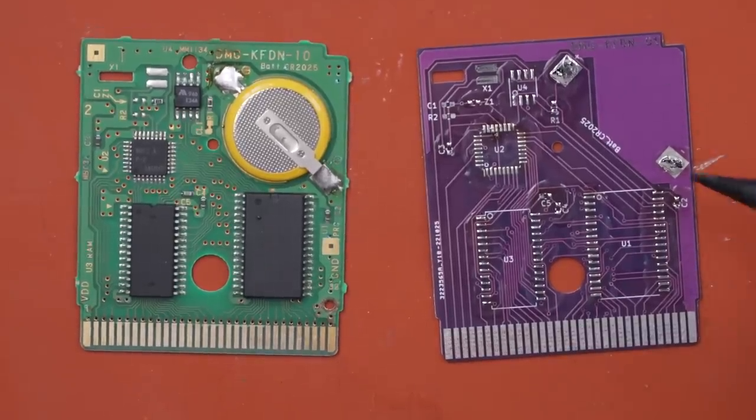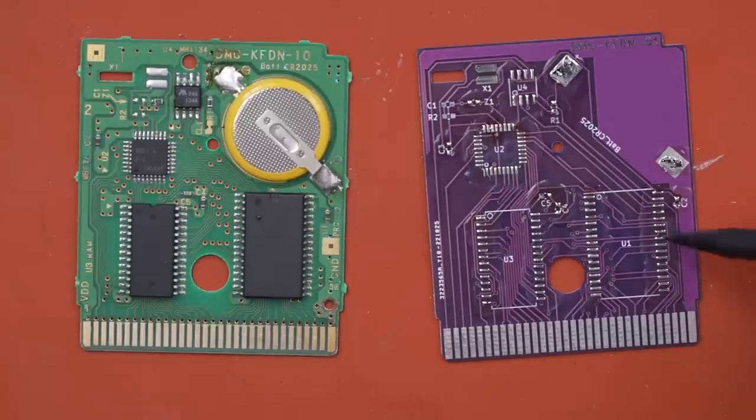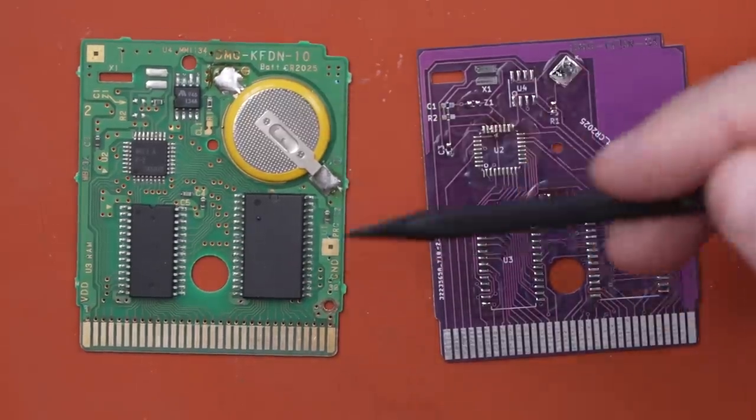Taking a quick look at our work, we've got a little bit of solder on each of the joints we need to attach components to. Now that there's solder on each of these pads, when I go to install the component it's going to stick much easier. Solder loves to stick to itself — if you have solder on a component and solder on a board, when you heat them up it'll stick almost like a magnet. Now let's get our hot air station started and begin placing components.